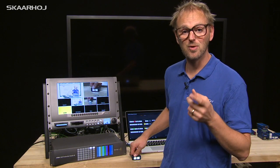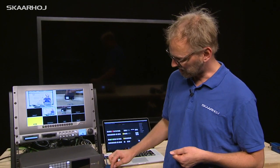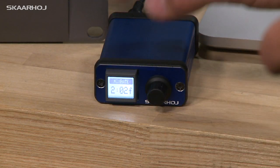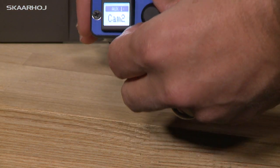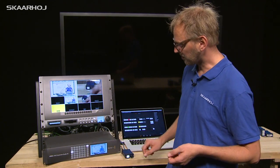The next micro is also based on smart switches but it has an encoder too, making it perfect for settings. We've programmed an example that changes four different settings inside an ATEM switcher. The first is the mix rate — the smart switch displays the current mix rate from the ATEM, and turning the knob changes it, then pushing it sends the value. Pressing the button again shows auxiliary one — you can turn the knob to select a camera source and push to send it to the ATEM switcher.